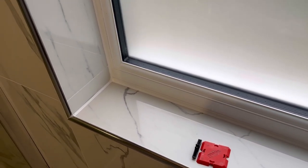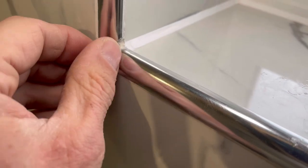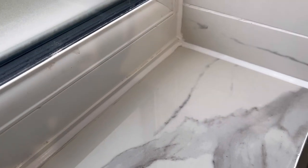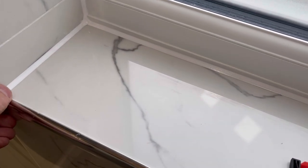Okay, I've done that now — I might have my worst critic on this but let me turn the lights on. So that is done now — I'll just tidy that up a little bit, there's a tiny bit of grout in there so I'll get that off. Like I say, that gives you a nice clean bead and there's no water at all. What we do with any small imperfections is a little bit of moisture on the finger and it's gone. Corners I struggle with — I really struggle with my corners — so anyone out there who silicones all the time, please get in the comments. I'll just touch them with a wet finger and sort of tuck and dab them in. So that's that one done. Doesn't take long at all — it's relatively easy. That's flat, it's square, it's all good.